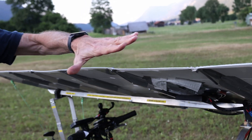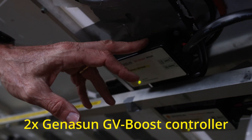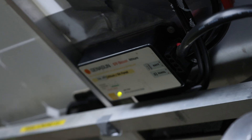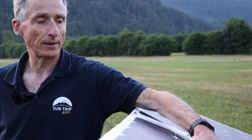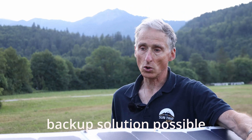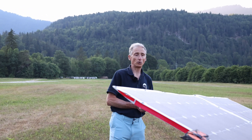The solar panels tilt manually — there is no solar tracker. The weight of just the solar panels and their structure is 10 kilos. We have two solar controllers, one for each solar panel. This is a bit redundant, but if one solar panel stops working, the other can continue with its own controller, allowing the trip to continue while the faulty one is repaired.